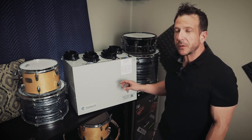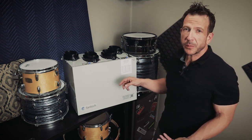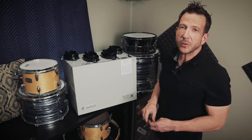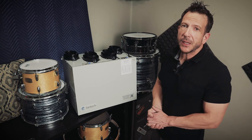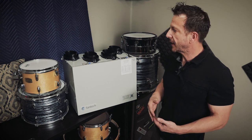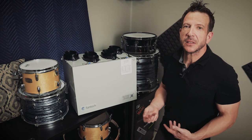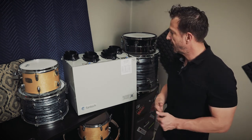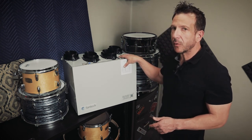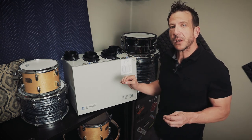So this particular unit will deliver about 110 cubic feet per minute, which is a volumetric measurement per unit time, at a static pressure of 0.52 inch water gauge or water column. That kind of sounds complicated, but I think it's intuitive. All that's saying is that the more resistance the fan sees, the less air it's going to blow through the system. But as you can tell, this is a relatively small piece of equipment. The air quantities here are relatively small because all we're focused on is ventilation.